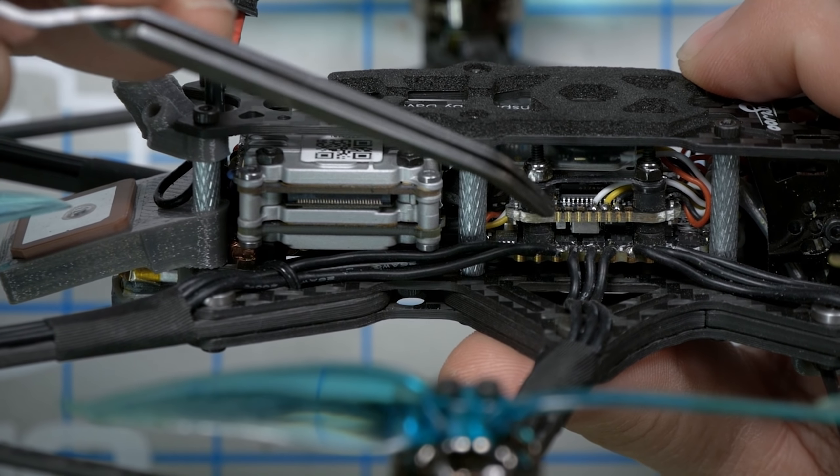The flight controller on the hexacopter has had a big upgrade. On the quadcopter it uses an F4 processor; on the hexacopter it's an F7. An F7 is faster than an F4, but that's not the main reason this is significant. The F4 has fewer UARTs, which meant they had to run the DJI on-screen display off a soft serial port — and that causes the DJI OSD to drop out and freeze sometimes. The F7 on the hexacopter has five or six UARTs broken out, and all functions — GPS, DJI OSD, receiver — are on hardware UARTs, so you don't get those OSD lockup problems. I hope they roll that change back into the quadcopter version.